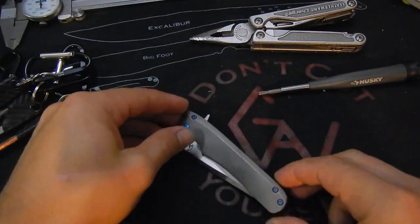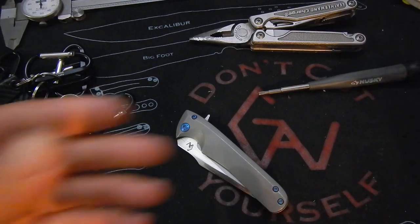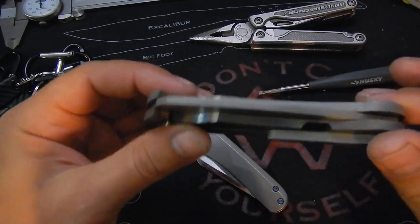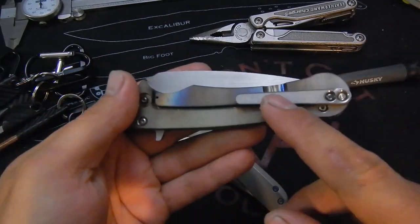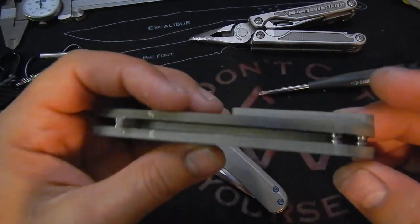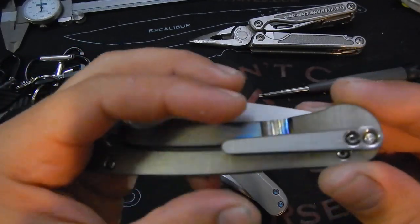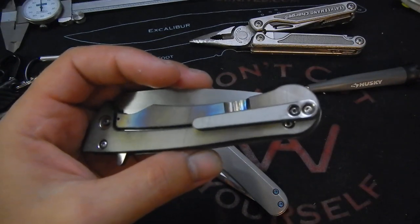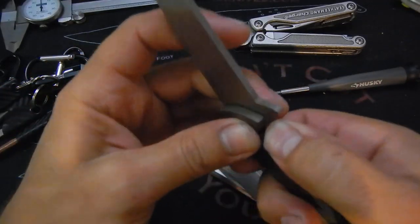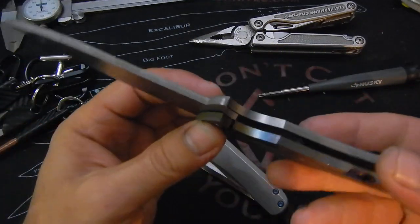Did this one today. What I did actually yesterday was I figured I'm gonna try something new, and I started batch 5 of these, 5 small flippers all together. So from the beginning, all the reaming out, counterboring the bearings, counterboring for the screws, countersinking all the screws, pocket clips, the tops, the threads, everything. Just not tightened. All that, detents, and the locks. So I did 5 of these in one day, like a prep work.